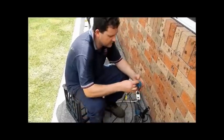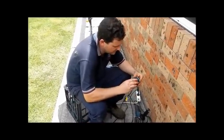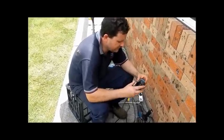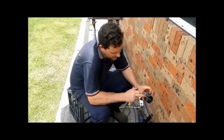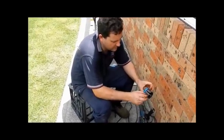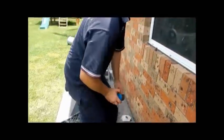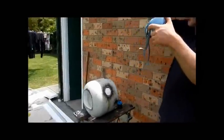We get the holder. We stick it on there. Now the wool's about 50mm thick, and I've got a mark here about 1 inch, maybe 20mm to 1 inch. So what we're going to do, we're going to cut through until we reach that mark. So come over here with our dust protection on because we're going to be working with this nasty stuff, and everyone will tell me how naughty I am if I don't.